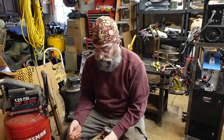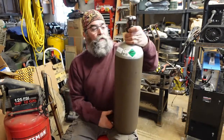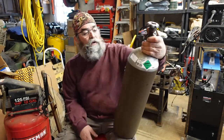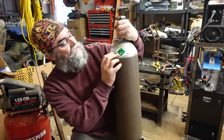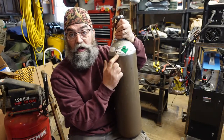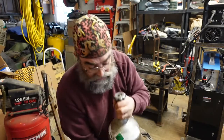Let's get that changed over. The gas is supposed to be cleaner than the flux core, so that's where I decided to go with gas. First thing you've got to do is get yourself a gas bottle. I went with a 60 cubic foot. I'm leasing this bottle instead of buying it to see if I like it. This is 75% argon, 25% carbon dioxide. Now we've got to hook it up to our welder. Your welder has to be able to accept gas — mine does, which is one of the reasons I bought this welder.